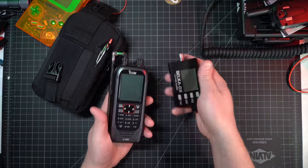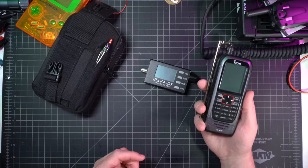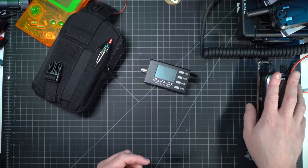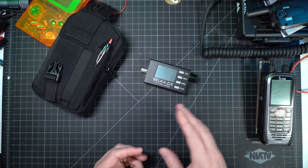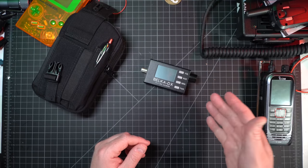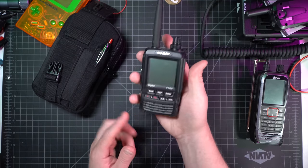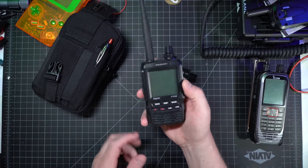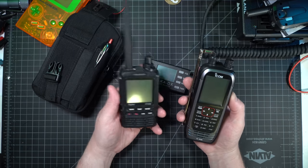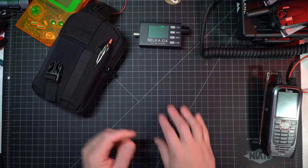So if you're at a hamfest and you found yourself a really nice handheld or mobile VHF/UHF radio, you could use this to test the receive side at least. If you're doing HF, you could bring this receiver along because it's light and tiny. This one's probably the way to go for HF, but if you're a VHF/UHF person, you may want something more feature-rich. You're not looking for the best receiver — you're just looking for something that can receive well enough to validate whether the radio you're about to buy works. It also has a record capability, so you can transmit into it to check audio.